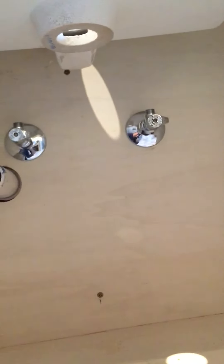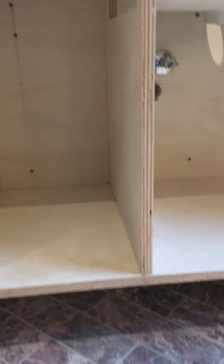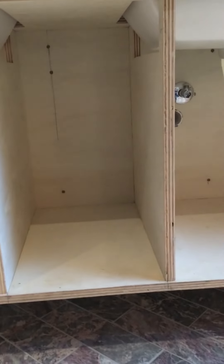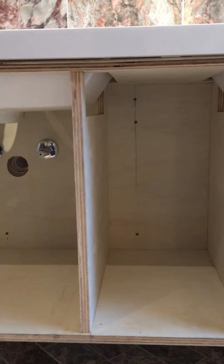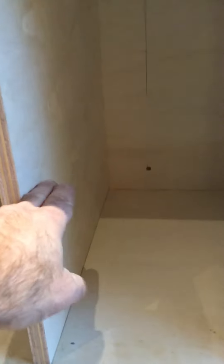The countertop has mounting tabs where you can get up through from below. Typically there's no top on these — it's just an open frame, sometimes a balloon frame with open backs too — but we had a couple of extra sheets of three-quarter inch plywood. We used a sheet and a half to put it together, put a top on it, and it gives a little more strength since it's hanging off the wall. The box helps with strength, and the two dividers let us mount the drawer tracks.